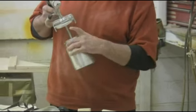Now, the second option, I know I jumped around. The second option to make the inside smooth and silky would be to coat it with a clear coat, something like the High Performance, whatever. If I really wanted to make it even tougher, then I could cross-link it, and I've got a finish that's almost bulletproof. But inside this corner cabinet, it's just not going to get that kind of wear. So I'm going to go with the wax. Now, in the event that you wanted to change the color, the only thing you do is clean it down good with some mineral spirits, get it wet, take a dry rag, clean it off. That removes the wax, and paint it again.